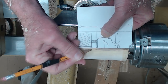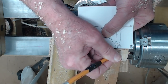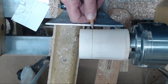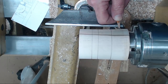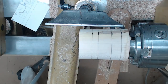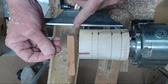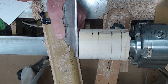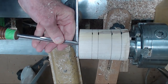This thing is going to be one inch thick. We're going to have about three-eighths inch wall on the back side, which we'll take down just a little bit. Here's going to be the beginning of the knob, and here's going to be the ending of the knob. This is going to be the depth, this is going to be the wall or the top of it, and this is going to be the bottom and top of the knob — we'll worry about that later. First thing we're going to do is hollow it to that depth. I set my shop-made depth gauge — I did a video on this a while back — so we can spot-check the depth as we go along. We'll bring up the tool rest so we can cut right on center.